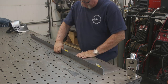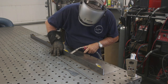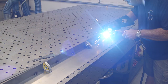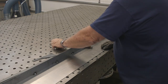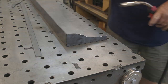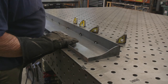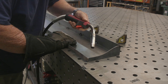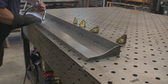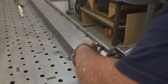For assembly I've got the mini mag squares — these work out pretty good for exactly this kind of thing. Just a couple of tacks every six inches or so is all I really need to hold this together. There's no structural load on this shelf at all, so I'm just tacking the side pieces in. I'll get the front piece on and come back later to weld the outside of the side pieces all the way in. At the very end of the piece you can see it drawing up as I weld — it's important to push it down and keep everything nice and flat.